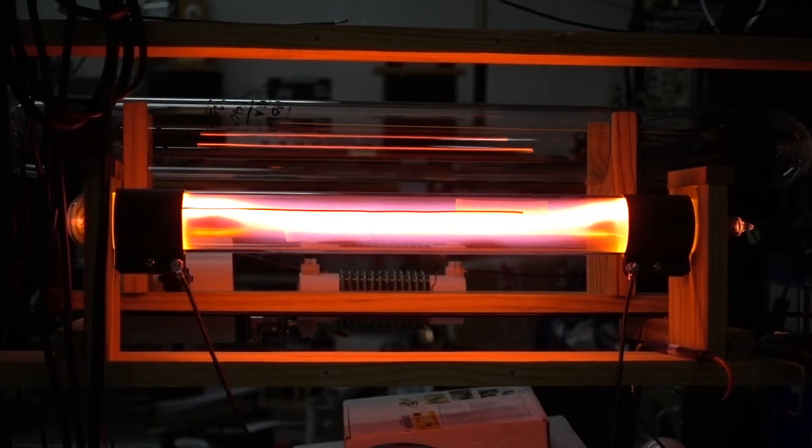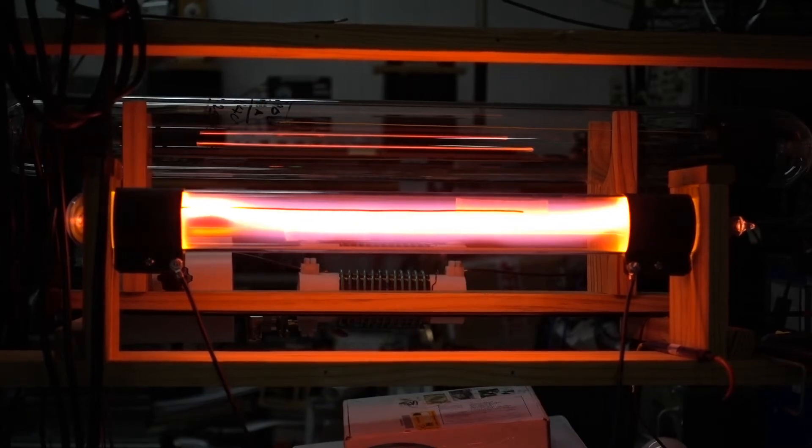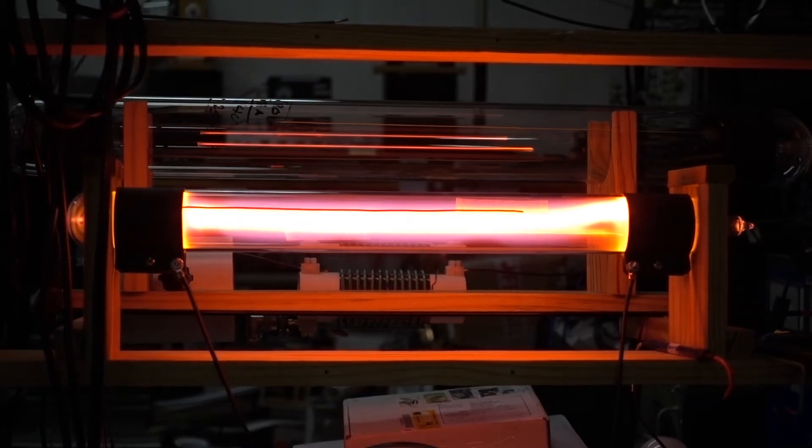The tube is being run here at 152 volts, and we're going to run it at fairly high power again to heat the wall up and clean it up to get the tube a little more stabilized. Even though it's doing some interesting displays, the current is stable all the time through the tube — it doesn't vary as the tube goes through these gyrations in color and beam pattern. That makes it easy to set up the amplifier because the tube presents a constant load. We're going to let it run at this power setting for a while and then proceed with our tests.